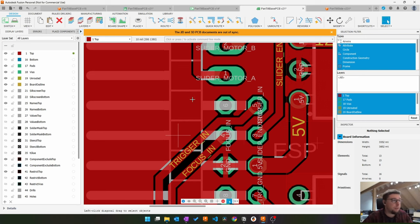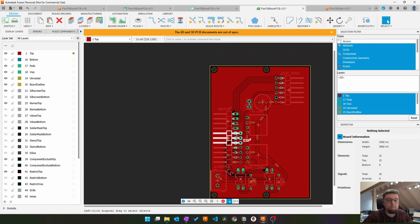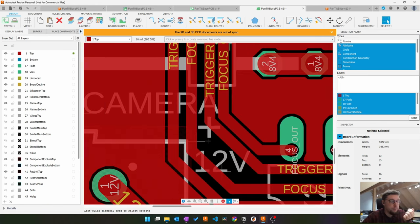Usually what I do now is to clean up the ground plane a bit. Well, this is not a high frequency application or anything with noise sensitive inputs. This is all slow 5-volt logic and high power motor signals, so they are not susceptible to any noise. But usually what you don't want is big gaps in your